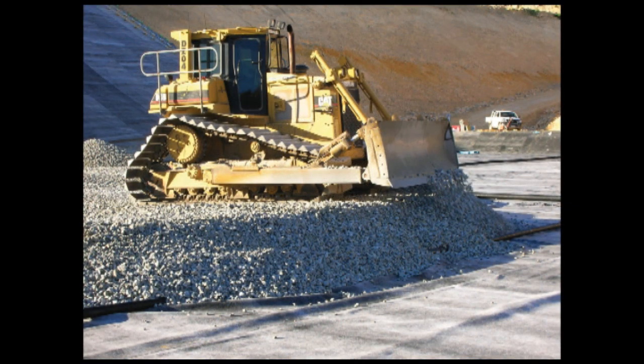This non-woven geotextile is being used to protect the geomembrane beneath from puncture. You can see highly angular drainage aggregate being spread in a thick layer. Therefore, this geotextile is also selected on its strength properties. It needs to be stronger than in our highway example because it supports a large, single-grade aggregate.